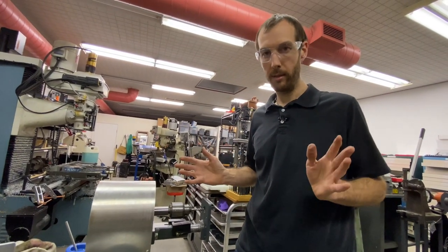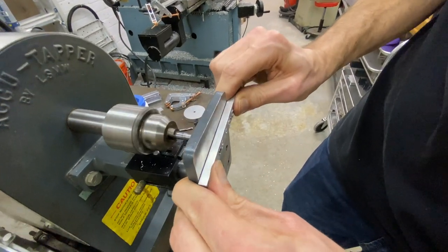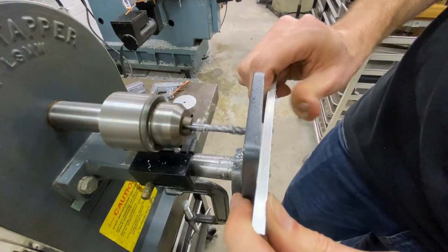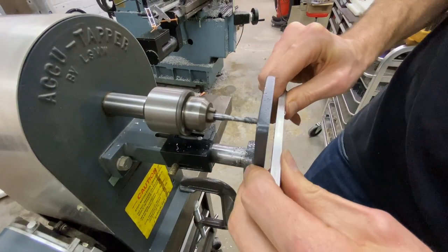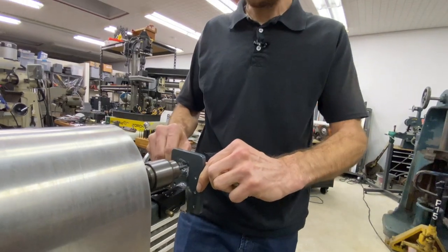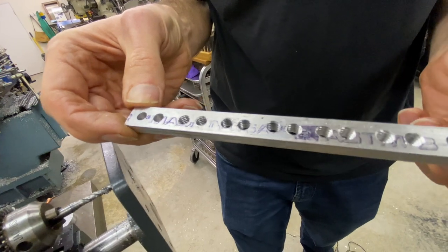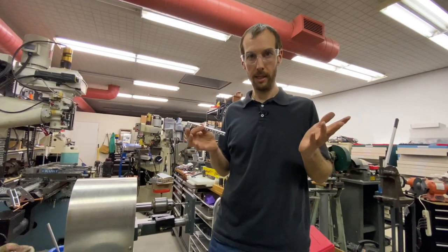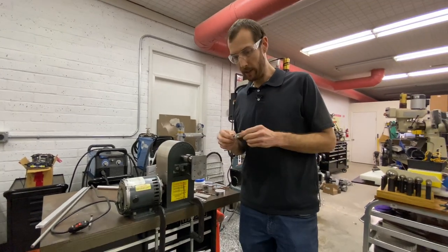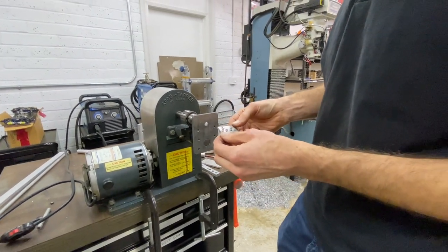You can go in and out of that hole as many times as you want — peck whatever depth you want. This machine is brand new to me; I'm literally playing around with it with you here on video. You can see where you can have a large number of holes set up on a part or strip and run through and tap them very quickly. It may even be faster than using a tapping head because you're moving the part manually and don't have to index the table to each new position — you're using the tap to align to the hole. If your tolerances allow that, this is a great option. It'll do whatever thickness you want, it'll do steel. We're playing with aluminum right now, and I kind of don't want to do this one bare-handed with all these burrs on it.